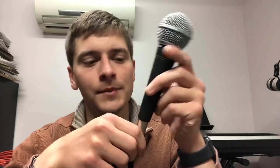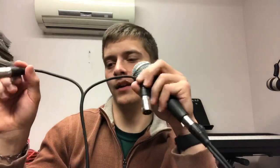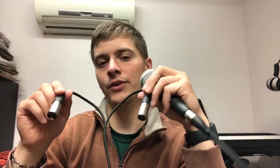There have been times where, if too early in the cable run — too close to the microphone — you introduce an XLR splitter cable and then multiple yards of additional cable, you'll start to introduce some noise. But if you do it close enough to your mixers — as I have it set up in the music area with just a single three-foot cable, one going into the PreSonus and the other into the Mackie mixer — then your signal stays very clean.